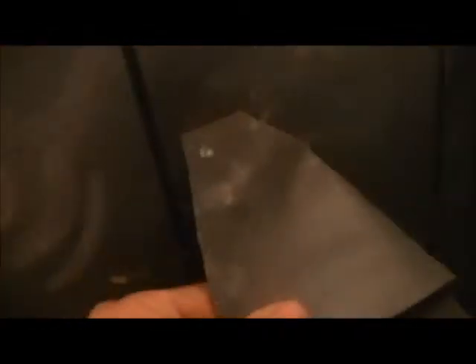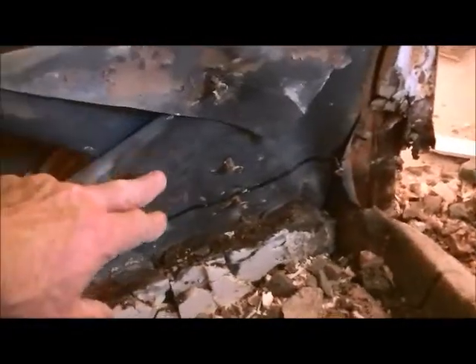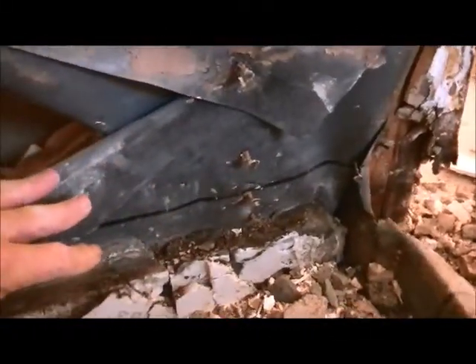They wrapped the seat that was in here, but used a secondary piece they never glued together, so it became really useless. There are a lot of nail holes where they put the pan in, and the nail holes are very low — right at the line of the shower pan itself. They're using a whole bunch of nails to attach the pan; it's just sloppy pan work. These pieces are scrapped in here, nailed but never glued. Part of doing any type of job is neatness, even if nobody will see it. They had way too much pan liner and never cut off the excess, so they just folded it twice on itself.